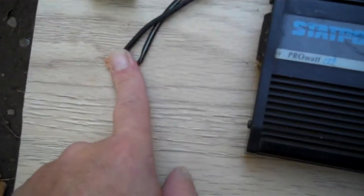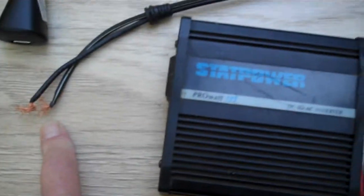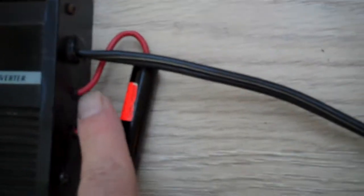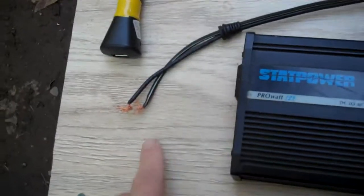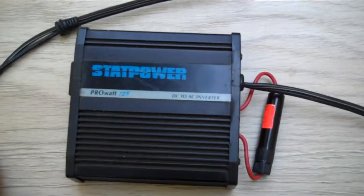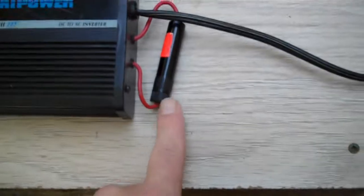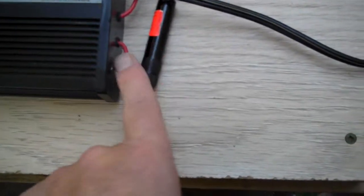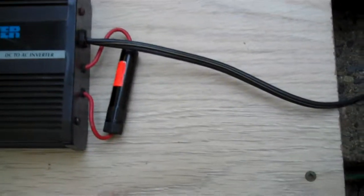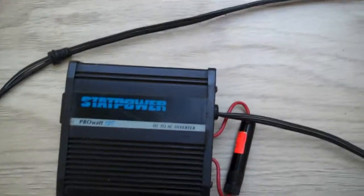It did have a cigarette lighter attachment on the end, but I cut that off so I could hook it up to my own power source. You can see I've added an inline fuse. When I cut off the cigarette lighter I ended up with reverse polarity, hooking it up backwards — blew the fuse right away. So I soldered into the board where the fuse goes a couple of wires that come out of this little inline fuse. Now I just have to unscrew this and replace the fuse quite easily with a very common fuse.